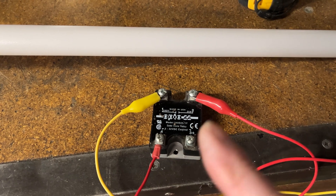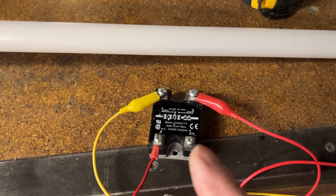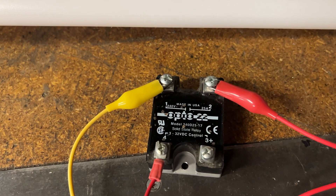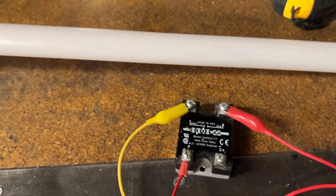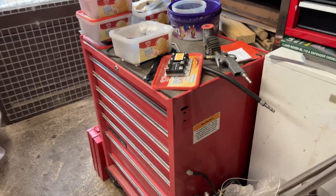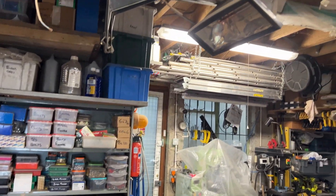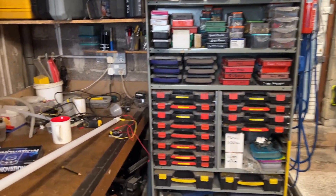Yeah, leaky solid state relays - be aware of that. The one I've replaced it with: I've still stuck with a solid state relay in the PIR, but I've gone for a Siemens brand, and that's rated at 0.3 of a milliamp leakage - not 14 milliamps like the Opto 22. So: solid state relay warning - if you're not aware, please check the spec. Don't waste your electricity like I've been doing for three or four years. I hope you found that interesting - it certainly was an eye-opener for me. Thanks for watching.